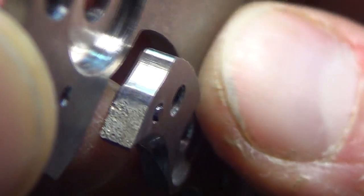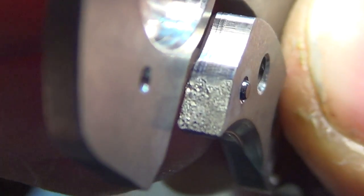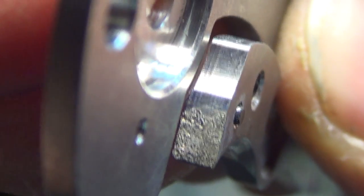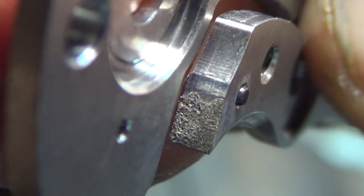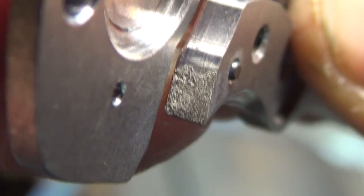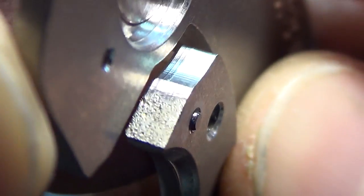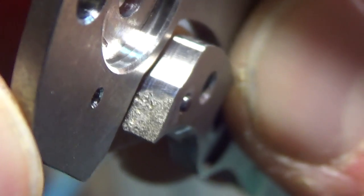There's a good view. So as you can see, comparing the other surfaces to the carbidized surface, it's got a layer of bumpy stuff on it. That's basically welded on there. Carbide deposits. Totally welded on there. And when you anodize it, it does anodize a color, so it kind of hides itself a little bit. But yeah, that's the basis behind the magic there.